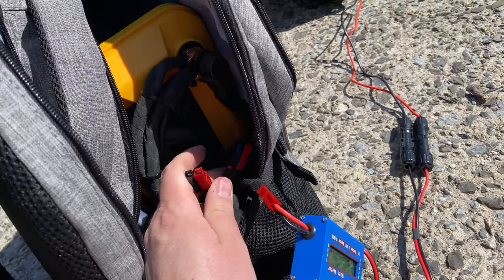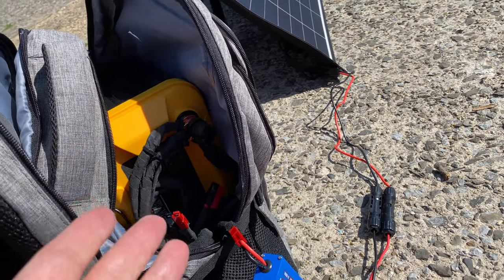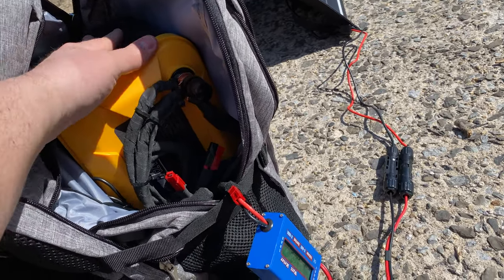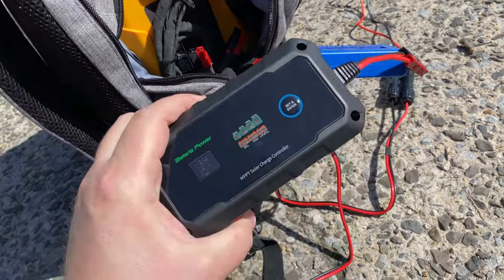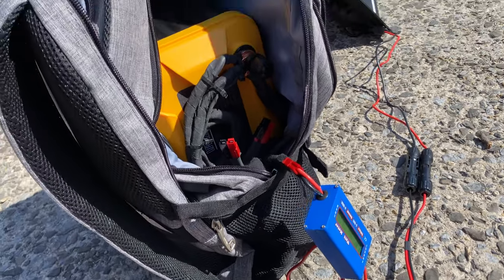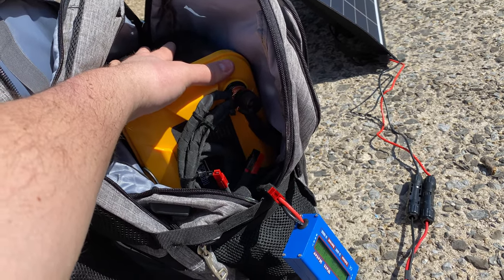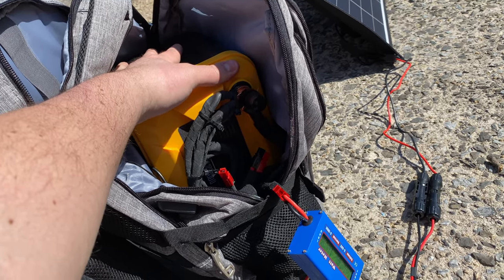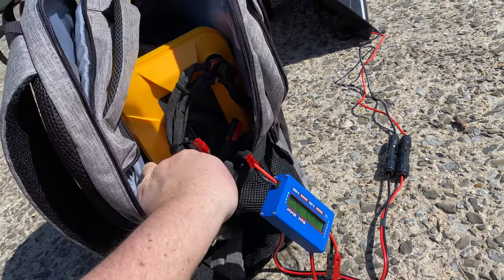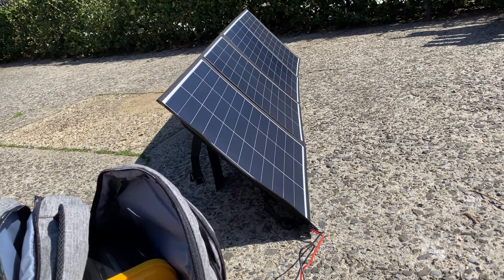This illustrates why DIY battery banks blow solar generators out of the water. I can put more amps into this with more charge controllers — let's say I connect six of these at 300 watts. I'm only limited by the maximum charge rate, which I think is about 100 amps. So 100 amps at 12 to 14 volts is around 1200 to 1400 watts. So that's kind of cool. Testing it all out and having a lot of fun — comment below and subscribe.